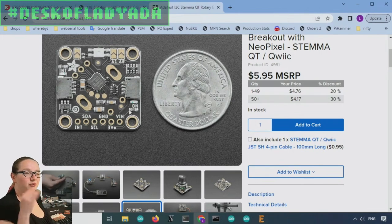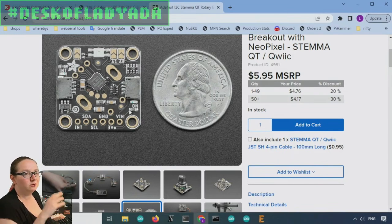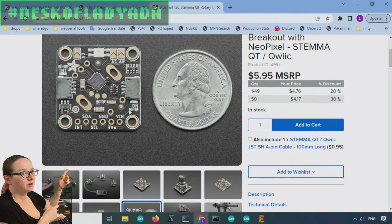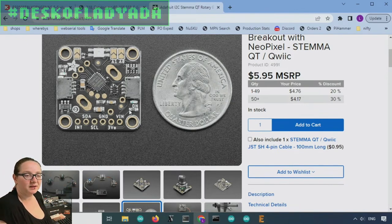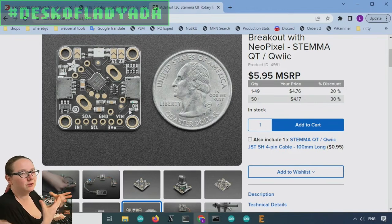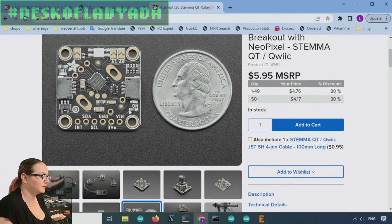And this is the original firmware that Dean, who was at Adafruit a couple years ago, wrote that allowed us to do I2C to anything conversion. So like I2C to ADC, I2C to rotary encoder, you'd program firmware onto this chip and then it would turn it into an I2C extender. This was basically because you can get I2C to GPIO, you can get I2C to analog digital converter, but there's no such thing as an I2C to rotary encoder, or I2C to NeoPixel adapter.